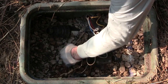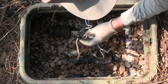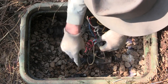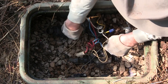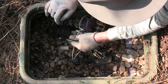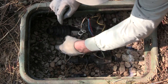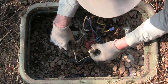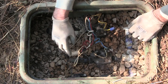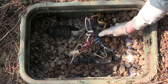These are the lateral remote control valves that operate these different systems. Let's look at the wiring. There are three different valves in this box, and all three solenoids each have a wire — one from this valve, one from the center one, and one from this one. All three come together on this white wire, so that tells us the white wire is the common. All three valves are connected to the same common wire. This valve here is connected to the red wire, the middle one to blue, and the last one to yellow. So white is your common, and red, blue, and yellow are your valve leads.